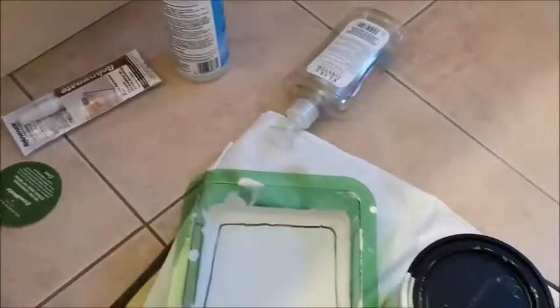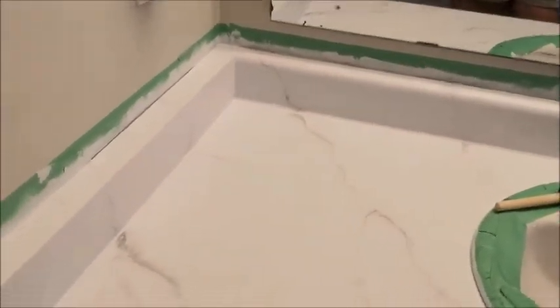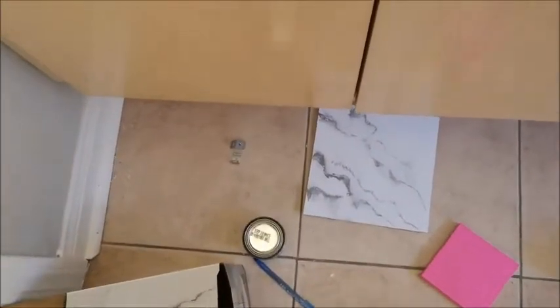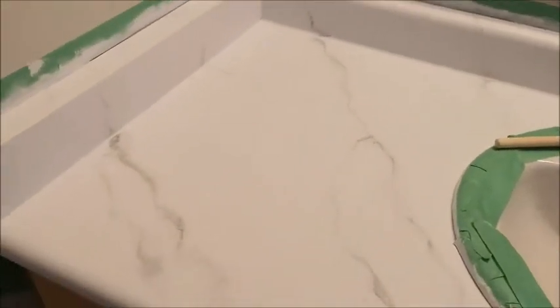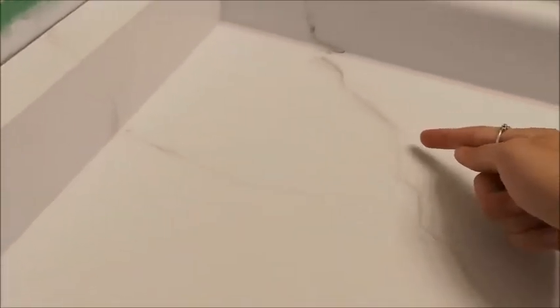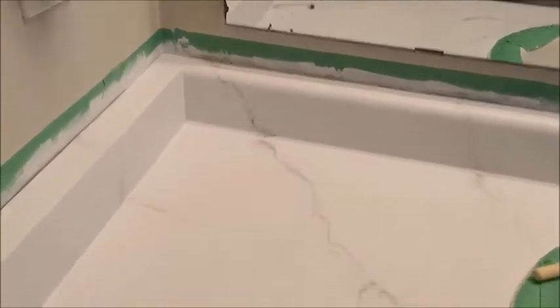In the kit contents I explained it came with the spray bottle, the larger brush, and the little brush. What you end up doing is using the little brush with as little paint as possible. I did try it on my practice board which also came with the kit, but I wasn't happy with the ones I started with near the bottom — it got easier toward the end of practicing. On the actual counter, use as little paint as possible on your brush. Work in very small sections — maybe four inches at a time — and keep it wet as you go, because if you go all the way down the countertop and then go back to spray it, by the time you try to brush it out it's already dry and can't be feathered out at all. So you need to work quickly, do small sections, and keep it wet.